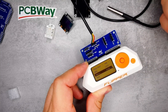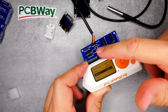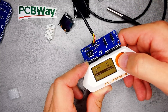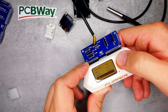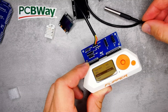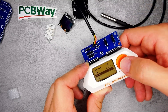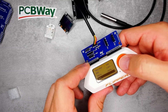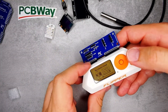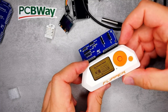Previously it showed me the address of the sensor, but it's just not doing that now. I didn't have the small pull-up resistor soldered before — if you're using a bare chip rather than a module, you normally need that resistor, though it was working without one before, probably depending on cable length. I added the resistor but it's not helping. Without getting the ID you can't save it. I've had this sensor for years — maybe it's just broken. Normally you'd save it and the temperature appears on screen.